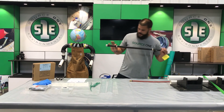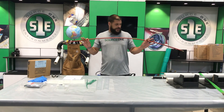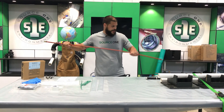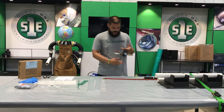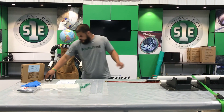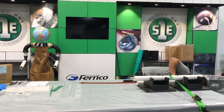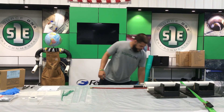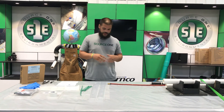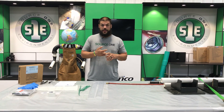You'll need your packer — we're using a two inch packer today. Your pushrods, which is how we're going to put the system into place, and then also a delivery method for the air so we can inflate. Your regulator, so we can control the amount of air that gets to the packer. You'll need some wire cutters, an air hose, and an air compressor — just a small pancake compressor would be perfectly fine for this repair.